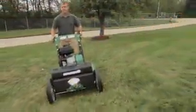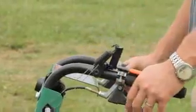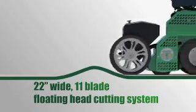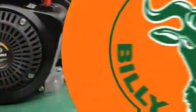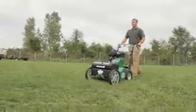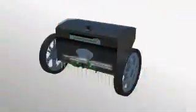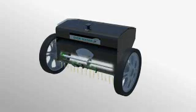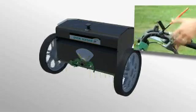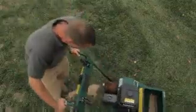Billy Goat's new OS900 series is hydrostatically self-propelled to reduce fatigue associated with pushing and features a best-in-class, intuitive right and left operator drive controls. This unit is 22 inches wide and features an exclusive 11-blade floating head cutting system that maintains contact with the contours of your yard. The unit comes standard with a 30-pound seed box with optional clear cover and excellent visibility from the operator's position. The box is also generously elevated above the turf to eliminate any clogging from moisture or dew coming off the grass. A simple axle-driven seed agitator bar eliminates the need for belts or tire-on-tire systems, which are wear items found on competitive units. The unit also features Billy Goat's exclusive Auto Drop System, which conserves seed and saves money by automatically starting and stopping seed drop with the bale engagement and prevents end-of-the-run seed piling found with other machines.